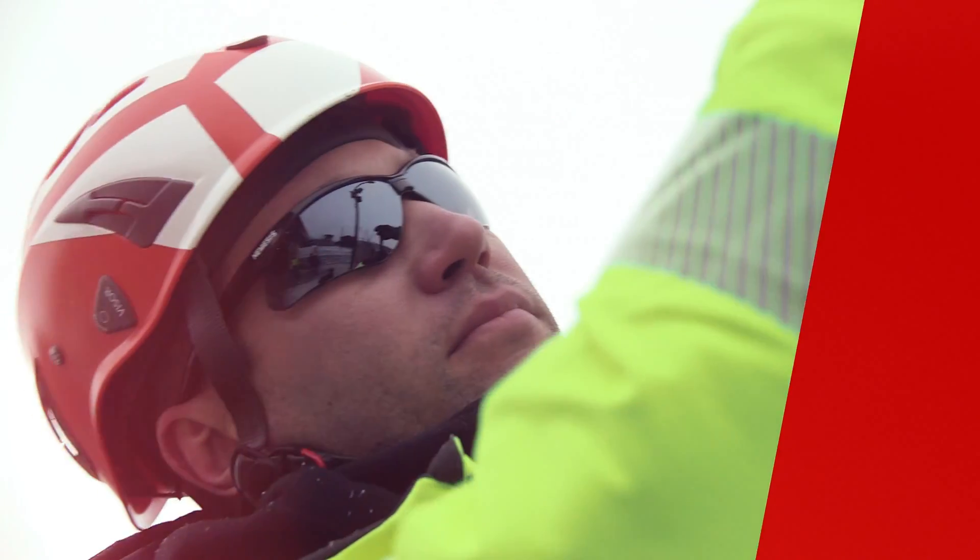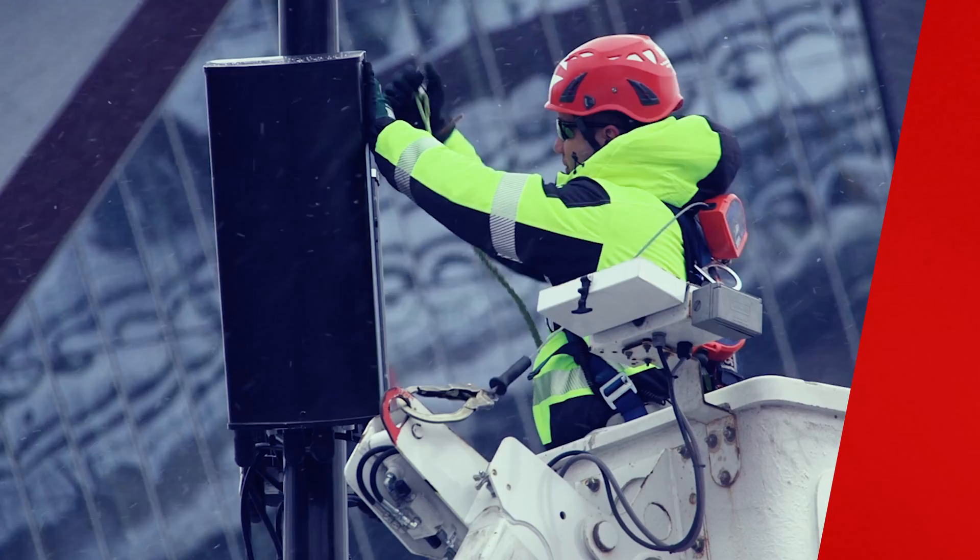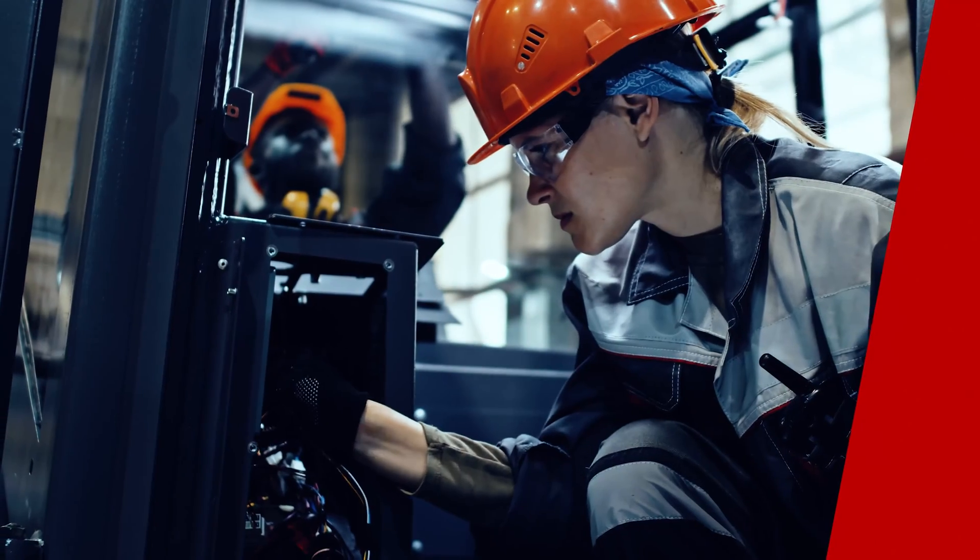Tower techs often install telecom electrical equipment. What are some of the safety rules they need to know? Most electrical telecom equipment is either Neg 48 volt DC or 24 volt DC. It's important that they test before they touch when working with this kind of equipment and understand if there is a live piece of equipment in front of them. It's also important to use safety glasses, gloves, and insulated tools when working near these batteries or DC plants.